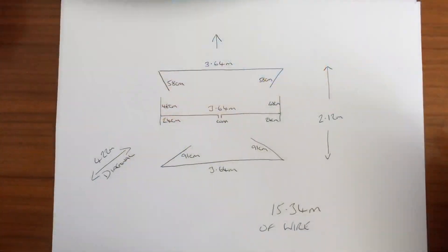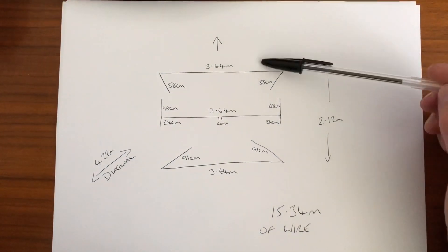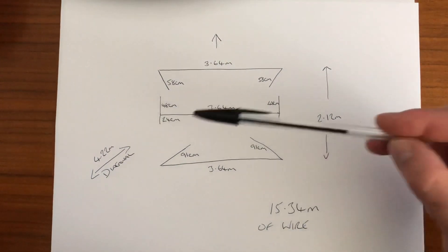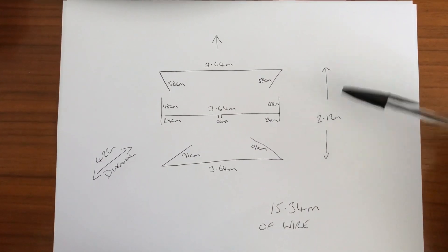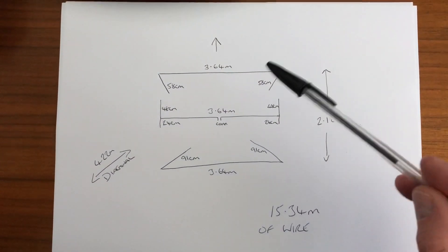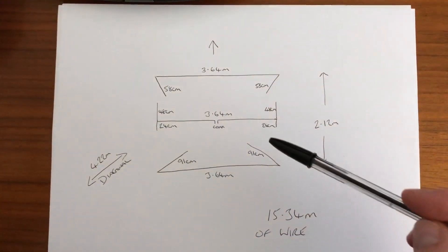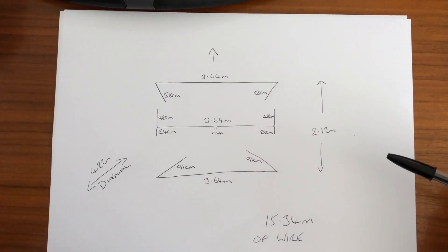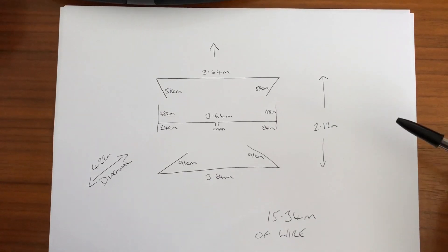So just a quick reminder of the 10m mini horse dimensions and the layout. That's the front — the director, that's the driven element with the two capacitive ends, and that's the reflector. Overall very short front to back, not very wide. Remember it's a rectangle not a square, so don't lay out your spreaders at a perfect 90 degree square. You just need under 16 meters of wire overall.